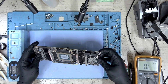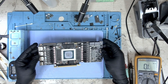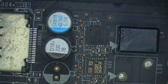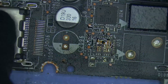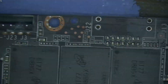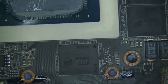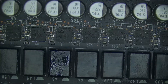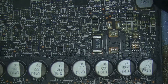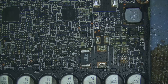The card has been opened. It looks a little bit weird — looks like some kind of water damage. Let's take a look under the microscope. Starting from the left, everything looks clean on this side. There's something on the fan connector, but apart from that there's nothing much to see. Moving ahead, nothing on the MOSFETs.